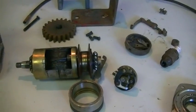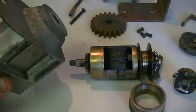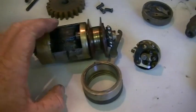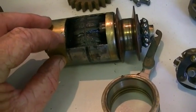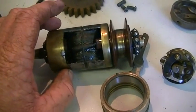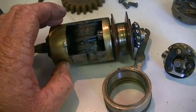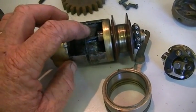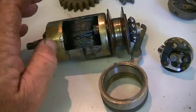The first hurdle here is the magneto — there's no spark. We've pulled the rotor out and the wire that was on there was actually broken off, so that's why we have no spark. There are two coils in here: one is 2.7 ohms and the other is 10.6 kilohms, and they both seem to be okay.